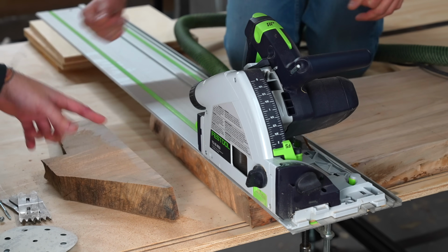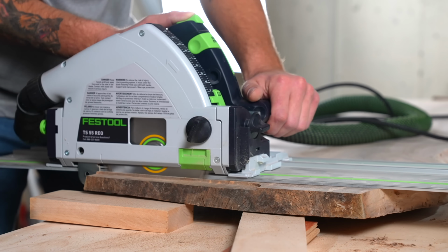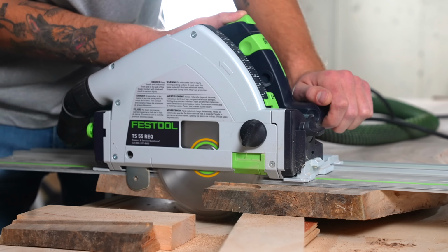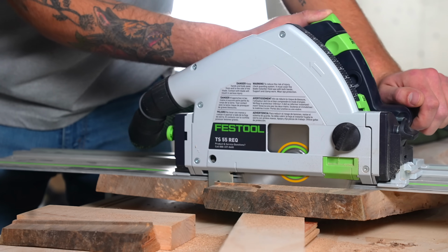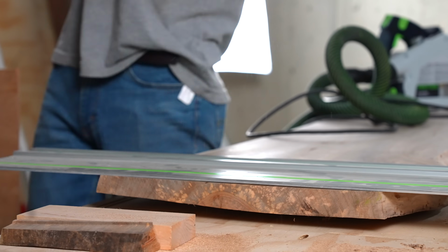On the opposite side of the slab was where we had the most taper, but we did remove a lot of it with this cut. So I just want to reiterate so that I can jump in front of the comments and say, I probably would have flipped the slab over after we flattened out the two sides of the slab first.